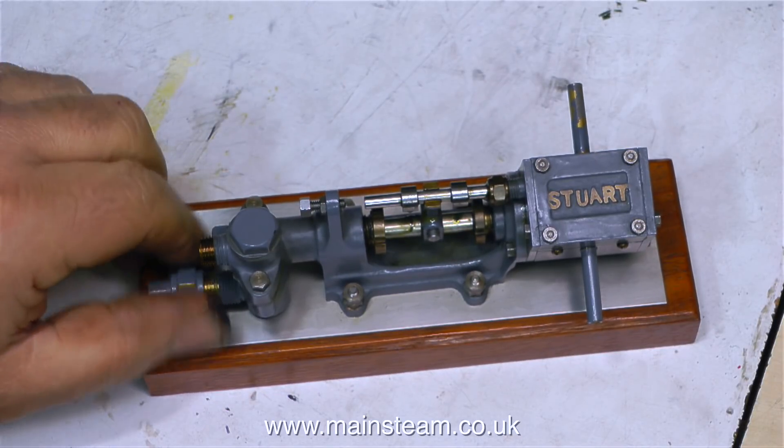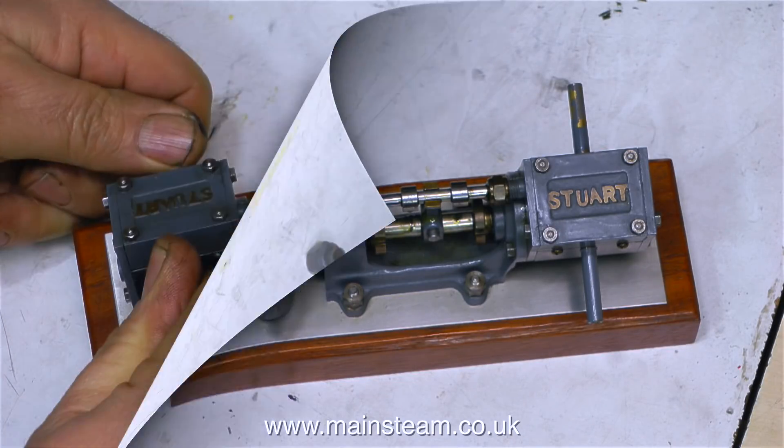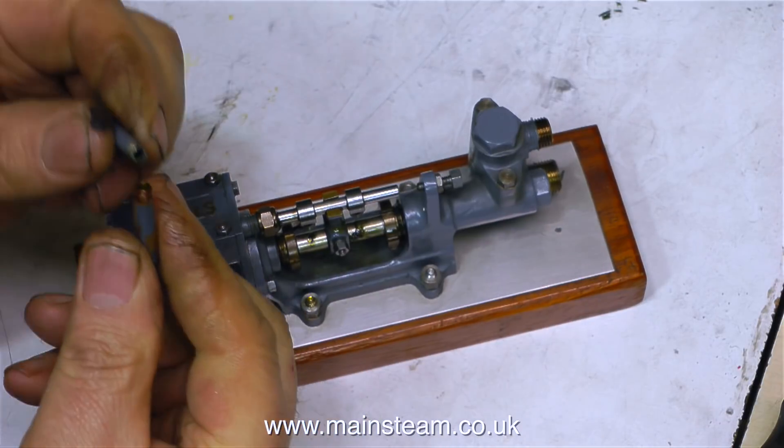The central pump rod is really two pistons in one, but in the steam cylinder end of the pump there's a larger piston. Irrespective of the size, a single cylinder steam engine can only start if the piston is in the correct place when the steam is admitted.